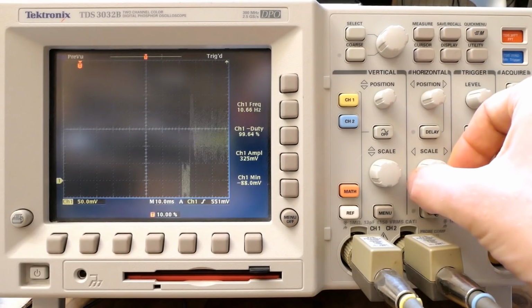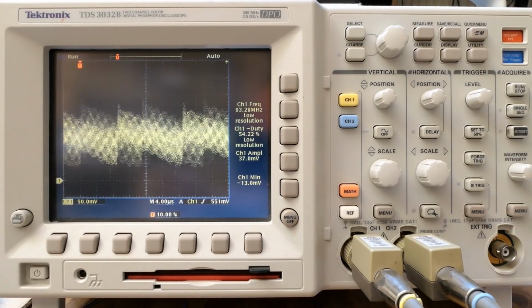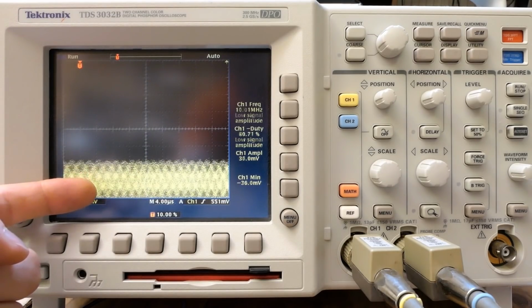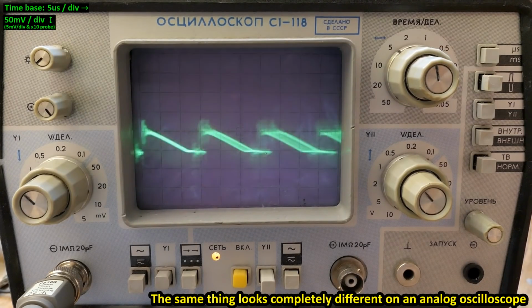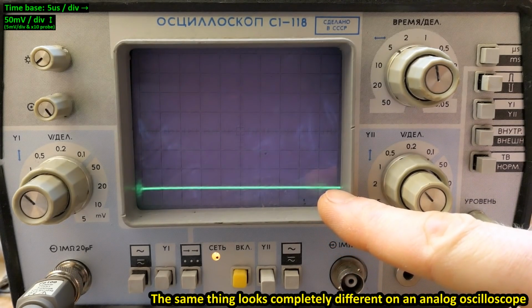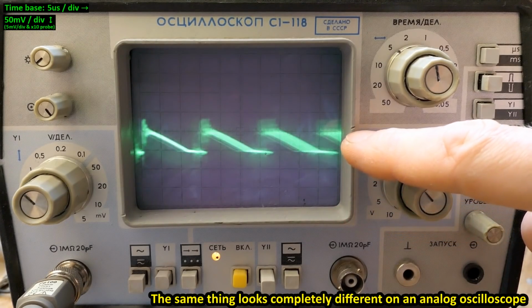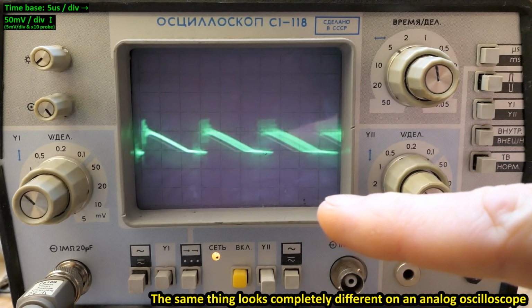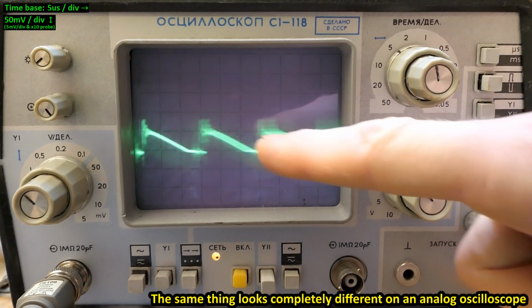What if I zoom it? It seems to be a sawtooth. And with just one battery it's alternating between this sawtooth and this. And of course analog oscilloscope time. One AA battery and connected to the current sensing resistor. And it alternates between nothing with a little bit of noise on it and this sawtooth, which is about 2 or 2.5 divisions. And it's again 50 millivolts per division. So it might be about 100 or 125 millivolts when it's active, when it's there in average.